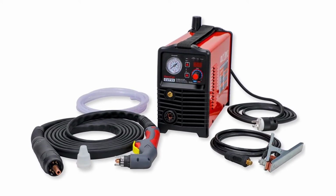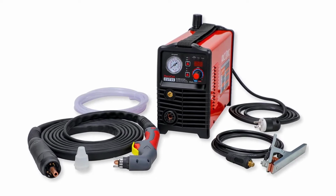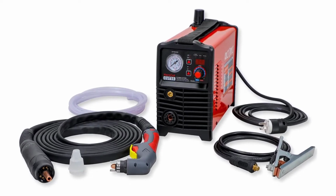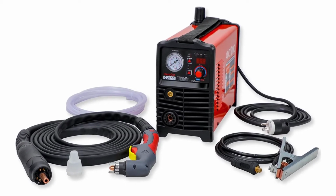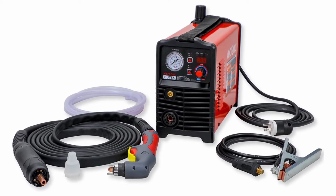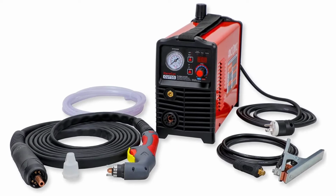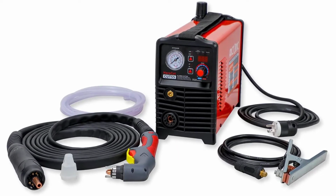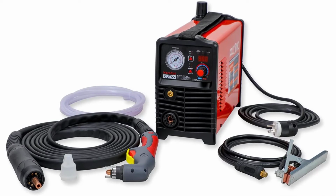120-240V input voltage, better to use a 63 amp power breaker. Quality cutting thickness is 14mm with 220V and 65 psi, 10mm cutting thickness in 110V with 65 psi. The machine can cut max severance 25mm under 220V if needed in a short time. Easy setup within 1 minute.